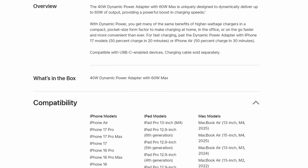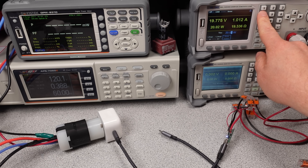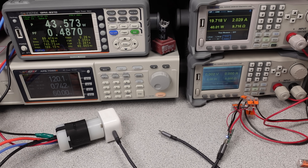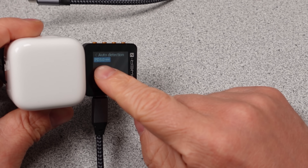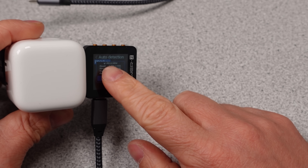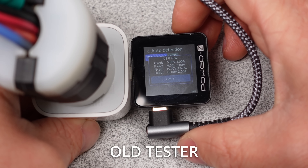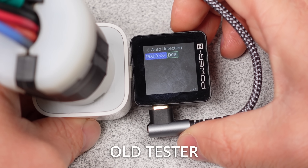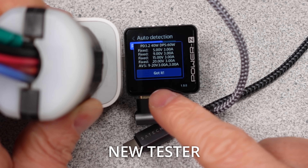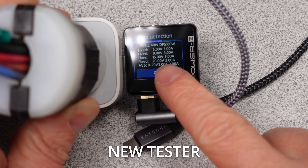Checking this adapter with an old USB tester, it can't even see the new mode, even running the latest software update. My other USB PD testers will also not show this mode. Effectively, if you plug this into an older device, it will strictly see it as a 40 watt USB power adapter, which is fine — this is what it is rated to do long term. PowerZ did good here, and they actually keep up with the latest adapters, so the software update for the newer version of the tester supports detecting and enabling the AVS mode present in this charger. The voltage modes can be selected, and if you choose the AVS mode and do constant current on the load tester, it will lower the voltage of the supply without overheating and without renegotiating or shutting down. So dynamic power adjustment — it's not anything PPS can't do, but hopefully it's more reliable.